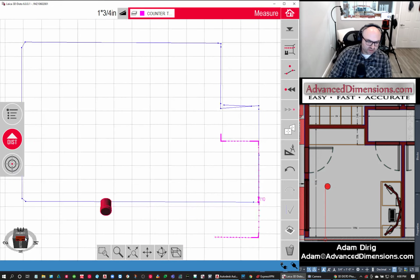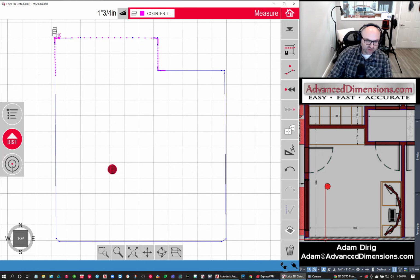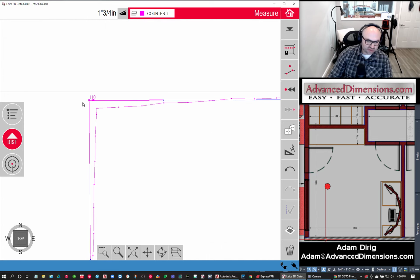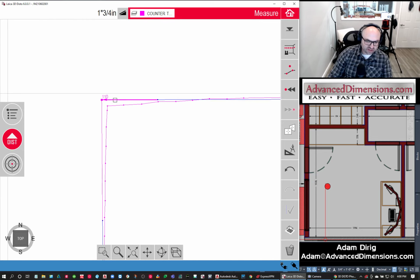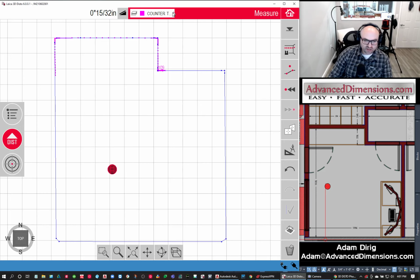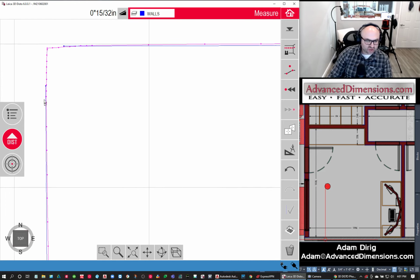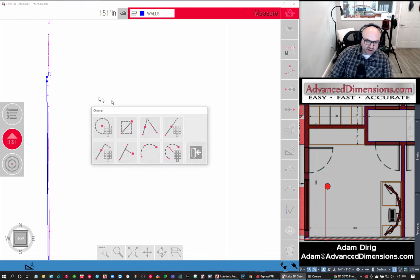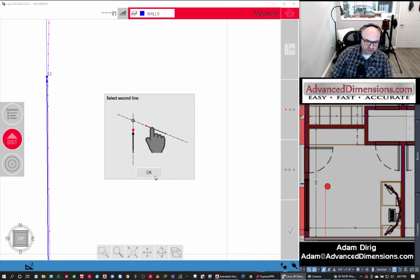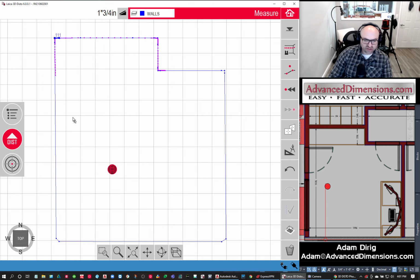This is just like AutoCAD. If you did what I just did where I got turned around, we can now zoom in and zoom out and see what's going on. Oh, it looks like these 2 points it added as my countertop layer because I'm in that layer. So we can do a couple of things. We can just trash these points, and we could change it back to our wall layer. Unfortunately, I haven't found a way to change the layers after it's been drawn. So that's one way to do it. Or I could have just deleted those lines and redrew them.